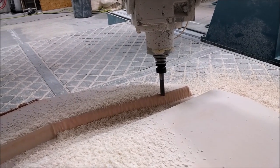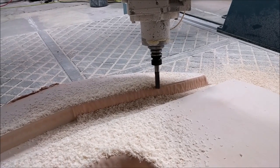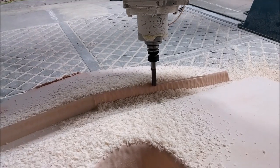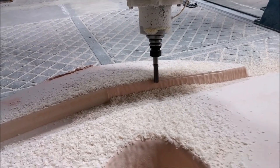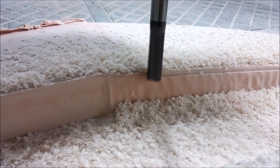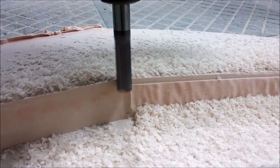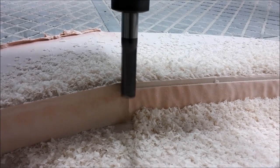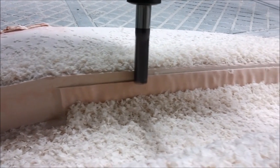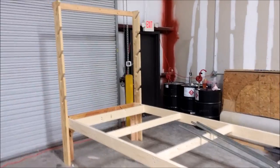Here we're using the same three-quarter inch diameter end mill, doing a swarf cut along the part. With a swarf cut you're using the side of the end mill, cutting off about a quarter of an inch on a step each time. You don't try to take it all at once, which would cause the bit to vibrate and bite into the plug.